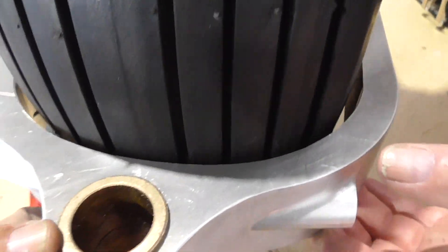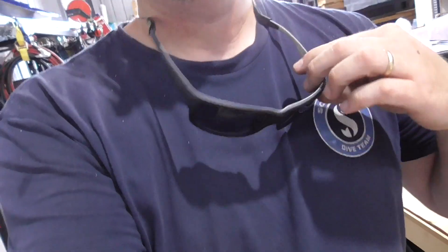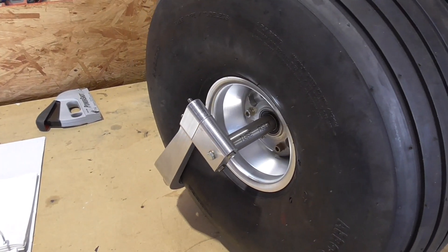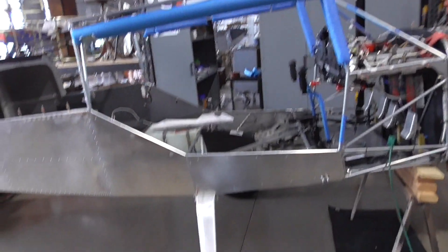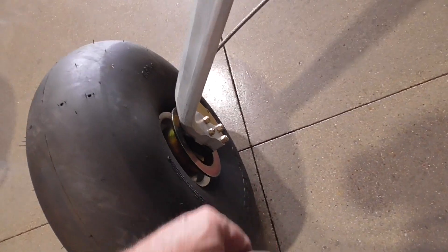So the bottom side has plenty — it's just the angle, and you can see where I made my sanding marks in there. If you get it at the right angle in the sander and just make light passes, take your time. It actually heats up pretty good. Bolts will need to go the opposite way. So I ordered another beam clamp to lift this guy up, and we're going to go ahead and get all this gear painted at the same time. That way it's done, can go on the plane and be finaled. That way they can tape it all off when they paint the rest of the plane. It'd be easier to paint it off the plane, especially — there'd be no way to paint all that without getting it on the bolts and brakes and stuff.